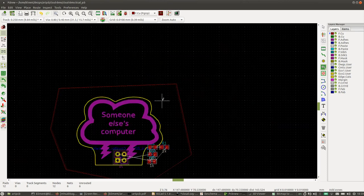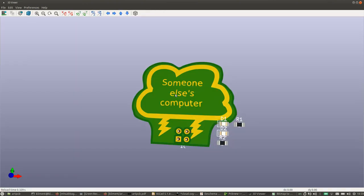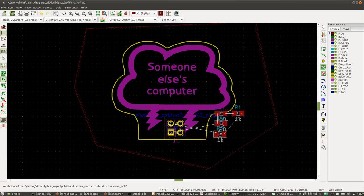It doesn't matter what shape this is as long as it's covering the whole board. And we go over here and there it is. Now when you make changes to a zone, or when you change anything that's inside one of those filled zones, it's not going to automatically fix itself. It's not going to automatically recalculate. So you need to press the B button